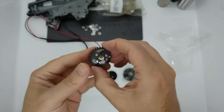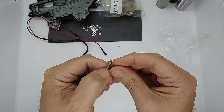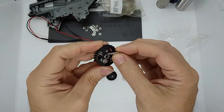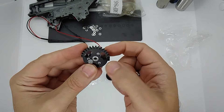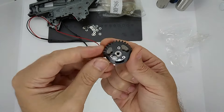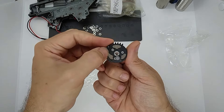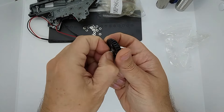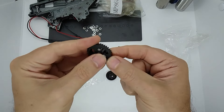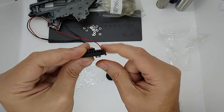They are perhaps a little bit over-engineered. The shaft that comes out is a very strong steel shaft. It's got a fixed brass or copper ring at the top, and it's got a bearing inside - it's a two-part design. As soon as I get them, I always make sure these are done up tight. It's a bit difficult to get underneath, but it will come out - it's not glued in, just pushed in. Don't hit it with a hammer; if you're refitting it, put it in a vice and slowly turn and it will just push back on.